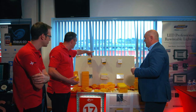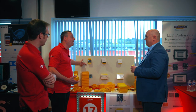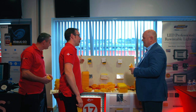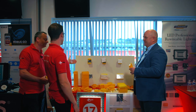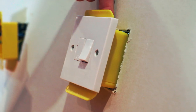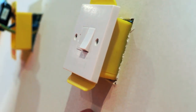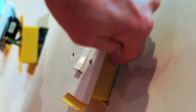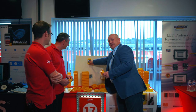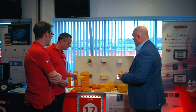And the finish is so much better, isn't it? Because we're going to get either a painted or plastered edge right up to the box and give that beautiful finish. The thing I love is what you said about tiling earlier — the tiler used to tile over the back box when you'd done the first fix, and you'd come to the second fix and break the tile just to get access to your screw on the back box. None of that anymore.